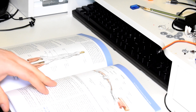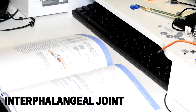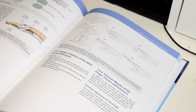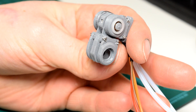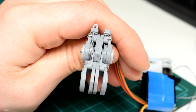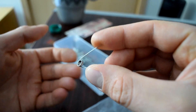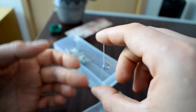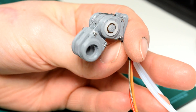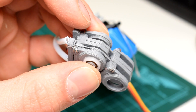As a starting point, I've been working on a new IP joint design — that means interphalangeal — because the individual finger segments are called phalanges. This is in theory the simplest joint design in the human hand, being a simple hinge joint. I started first of all with a much improved cable actuation system which uses a pulley at the joint itself. The main reason for that is that it completely removes the need for torsion springs, which are a major, annoying, and difficult-to-acquire and unreliable factor in the original design. It also means there's a consistent application of force throughout the entire range of motion.